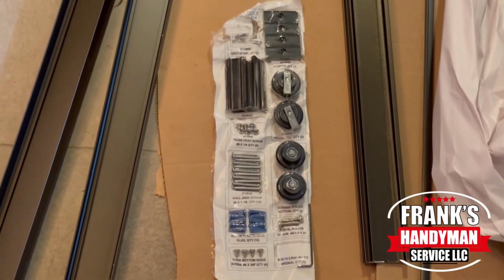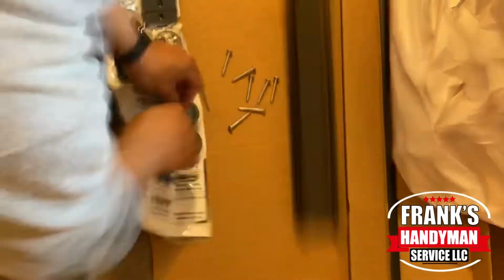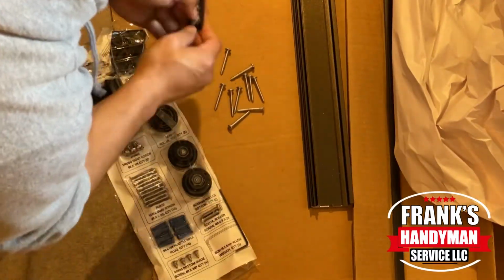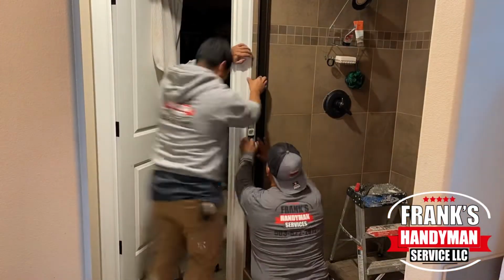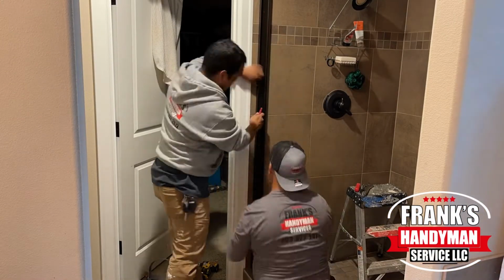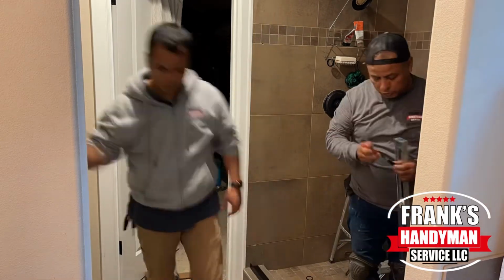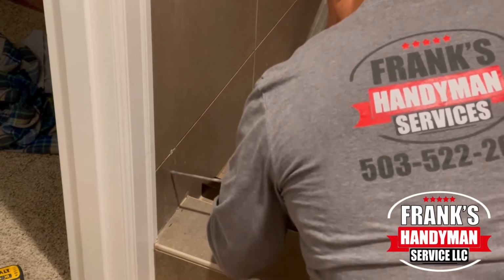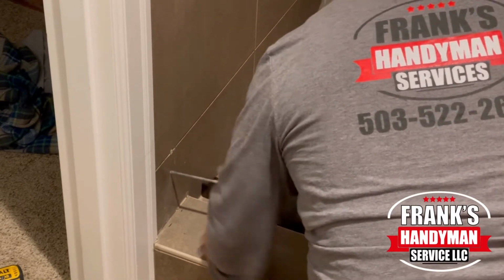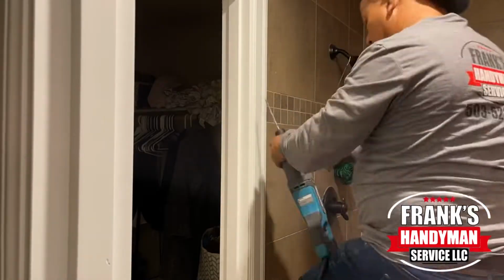Now the box has instructions, all the screws and everything you'll need. It comes as organized as best as possible. The first thing is we're going to be installing the metal railings on either side. These are secured with 3 screws. Once you put it there, align it up so it's plumb. You'll want to mark the holes in the 3 areas.